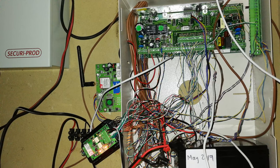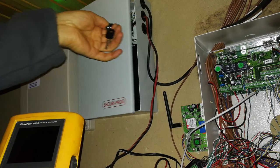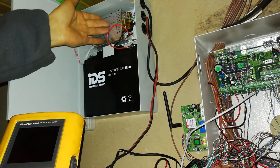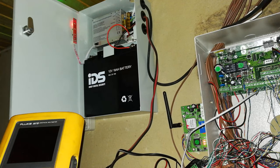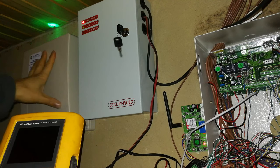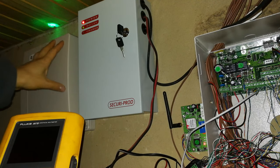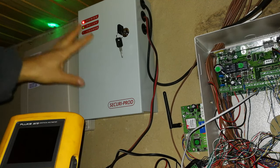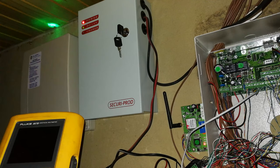What people can do is use an external power supply. Here you'll see an extra external power supply with a nice big 18 amp hour battery and a 5 amp power supply. Here's another one from a competing manufacturer using a CSB battery - a similar thing, this one also giving overload protection. These give you the extra capacity so that your alarm lasts longer.